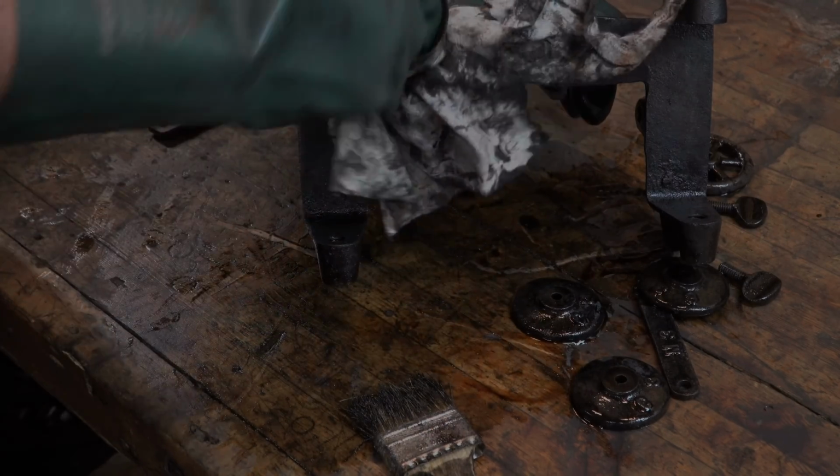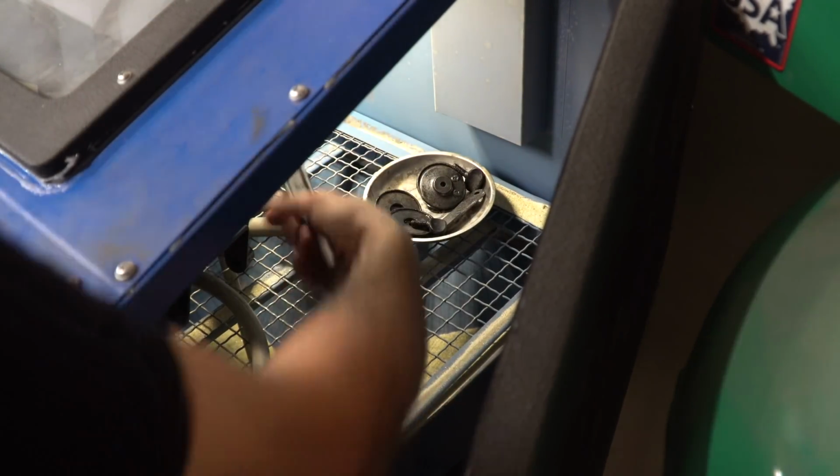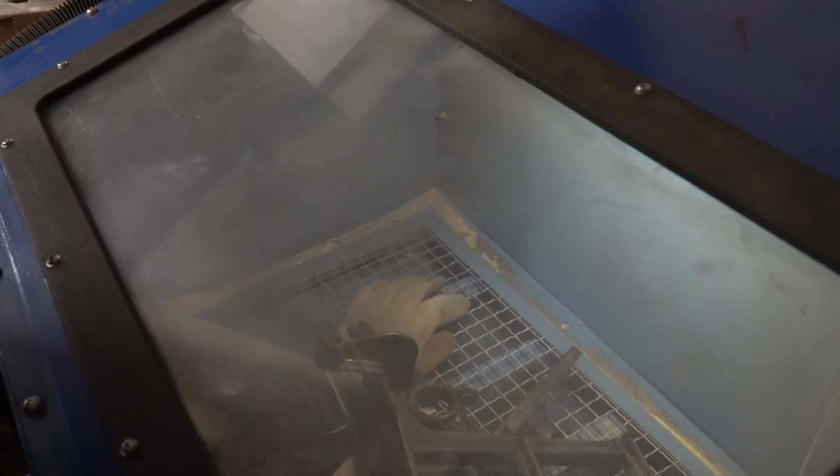You can always tell it's Japanning because it melts instead of wrinkles or peels. It just melts into a goo. It's really odd, and still very difficult to get off. You can see how much is still left on that the paint stripper couldn't eat through for some reason. But that's fine. Sandblaster does the blasting.